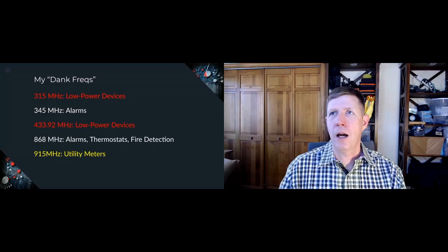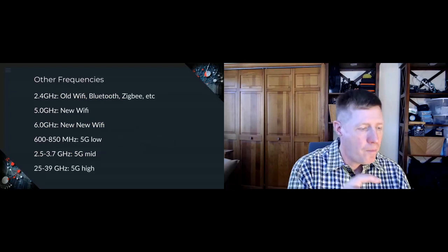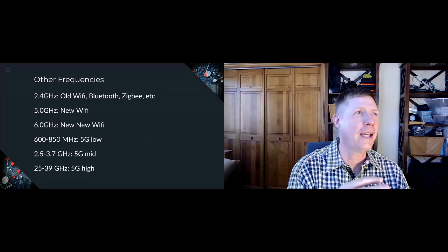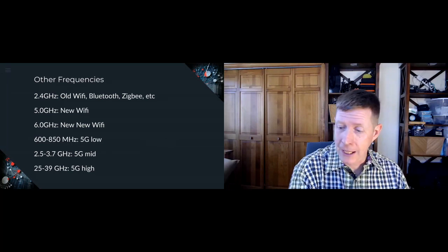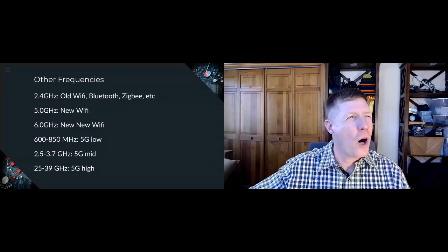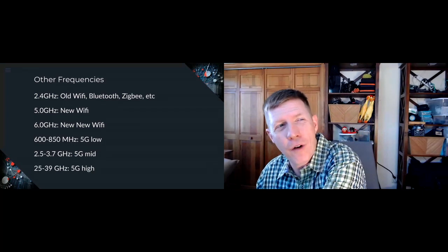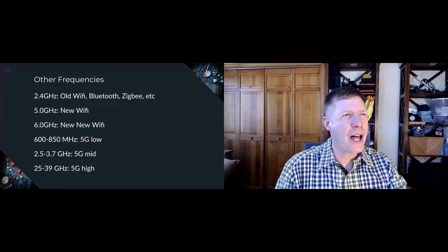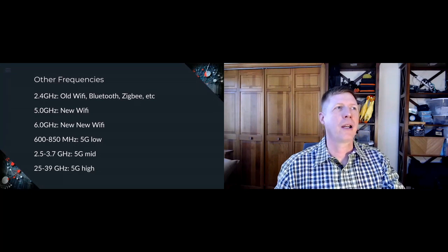All right. Other frequencies, things that everybody always asks about. 2.4 gigahertz is used by old Wi-Fi, so the old slower Wi-Fi. Bluetooth definitely uses 2.4. Zigbee. I have a Garmin watch. The sensors for that use Ant Plus. That's on 2.4 gigahertz. So a lot of like personal networking, wireless networking stuff are on 2.4 gigahertz.